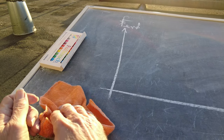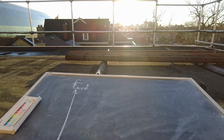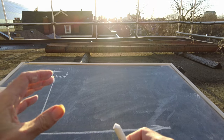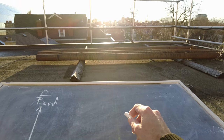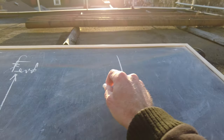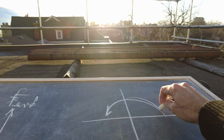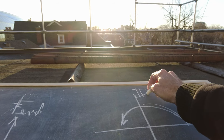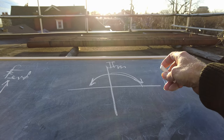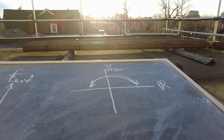Unlike the radar signals, you see the radar signals are complex, which is useful because then you can tell the difference between whether something's coming towards you and going away from you. You can tell the difference between positive and negative frequencies, which kind of means whether you're going clockwise or counterclockwise around the Argand plane, if this is your real axis and this is your imaginary axis.